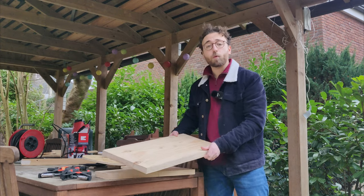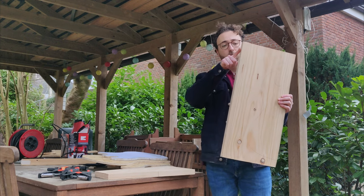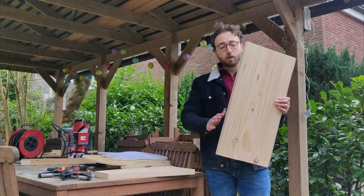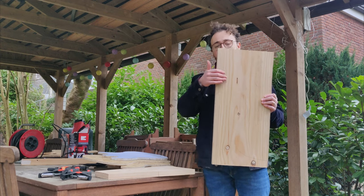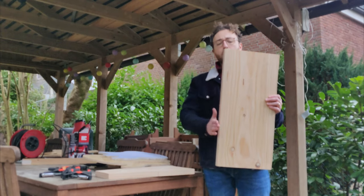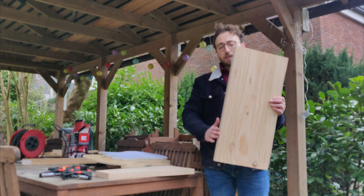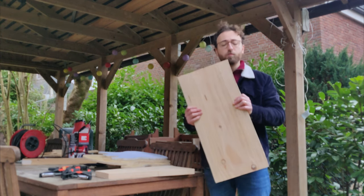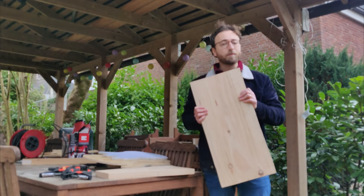What I need to do now is prepare the wood for the body blank. I've given this a practice run on one end using a router and a straight edge, and it turned out pretty good — it's straight and at a 90 degree angle. I need to go over it with a straight edge and some sandpaper just to really plane it out. But that was just a practice run. I'm going to do it on this side now so I can start gluing the body together.